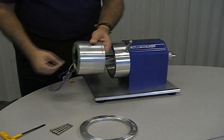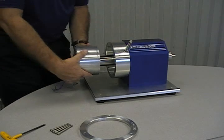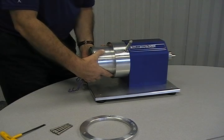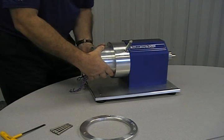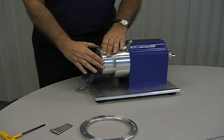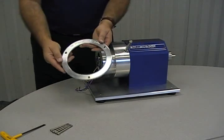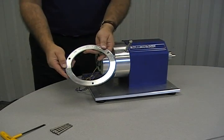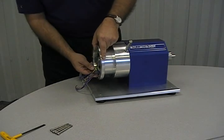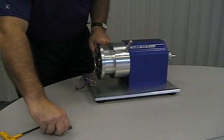The stator for the KBMS 35 is rather long. Care needs to be taken when inserting it into the adapter. If it is started at an angle, the stator can bind in the adapter and will be very hard to remove. It should slide in easily with very little force. If it does not start well, realign it and begin again. Slide it in until the stator bottoms out in the adapter. Mount the stator with the wires at the bottom to keep them clear from the shaft.